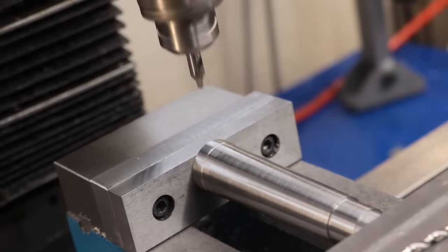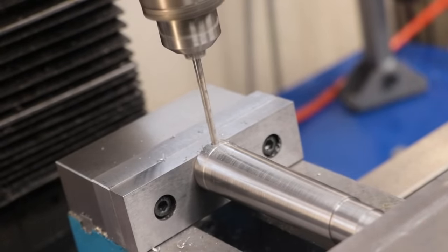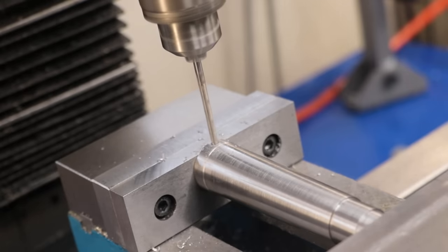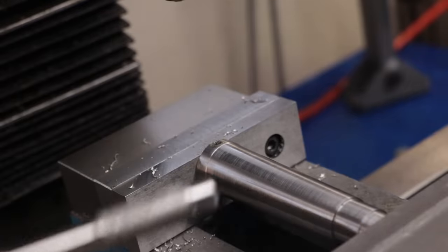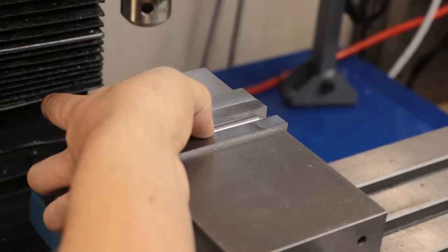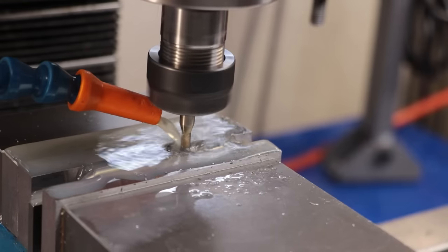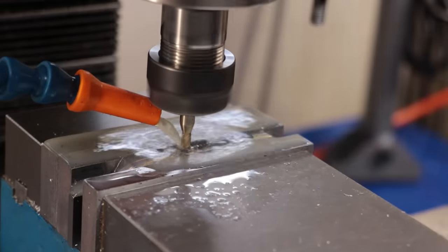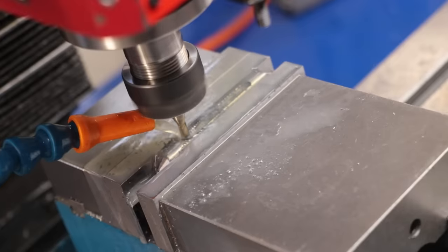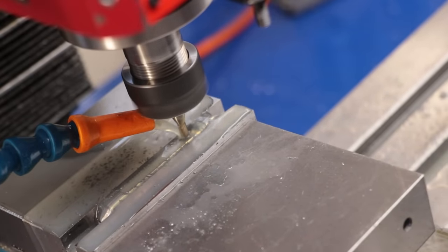The final thing left to do is make a way of retaining the center so it isn't pushed all the way out the front by the springs. I'll drill and tap a hole for an M4 grub screw on the main body — and once again a tap follower would have come in really handy right about now. The center meanwhile will get a four-millimetre slot milled into it. I'm using a milling machine because it's more convenient, but if you don't have one, you could load an end mill into the chuck and hold the center in a tool holder, or simply file in a flat edge on the center.